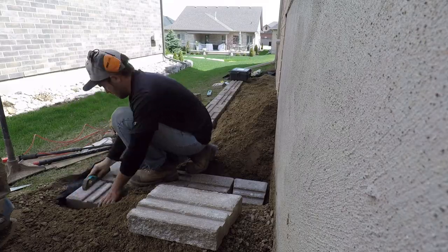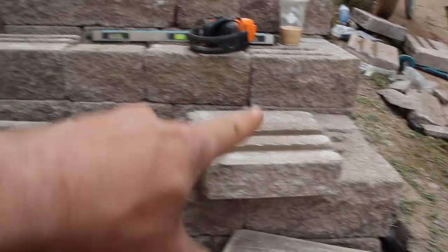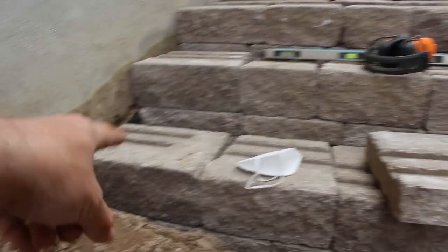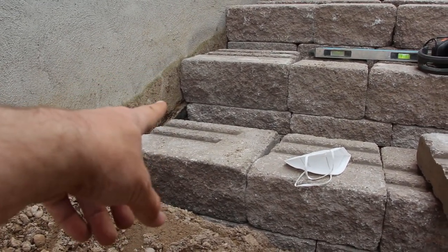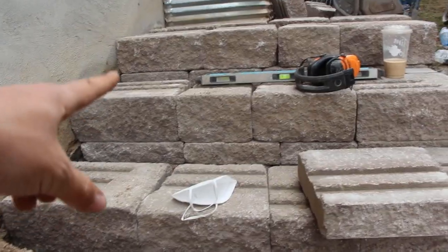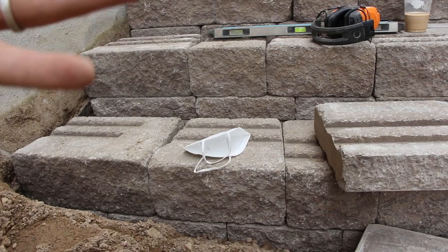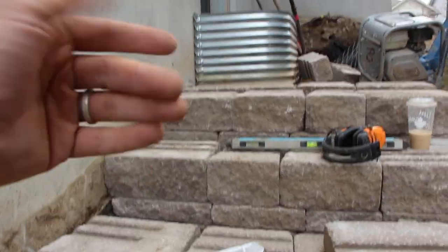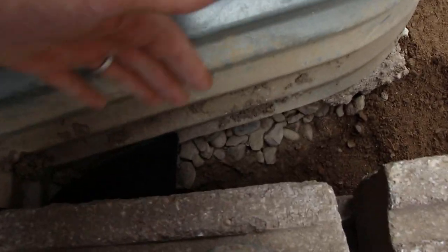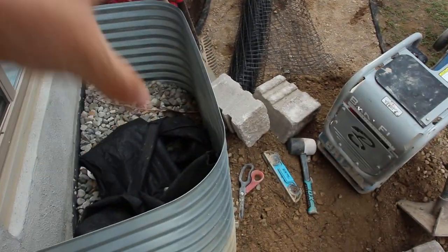These steps gave me some trouble because I wanted a nice little walkway at these steps where we're not too far off grade and wouldn't need a retaining wall. Unfortunately, the waterproofing of the wall starts there, so I needed to step it up to cover that, and then it didn't make sense to have a walkway there, so I stepped it up again. I went to plan B: measuring my step treads at 16-16-16-16-16 inches to make sure the final step tread meets the window well, then starting our three-foot step tread there and moving back up to four-foot treads once past the window well, making a nice gentle curve out of it.